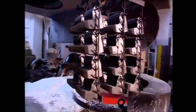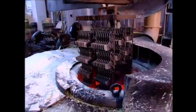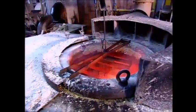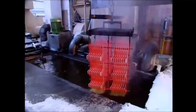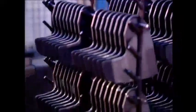The blade is nearly ready to be attached to a mower, but there's one safety measure it has to go through first. You know you're supposed to clear your lawn before you mow it, but sometimes you forget. If the blade were to hit something solid, it could shatter, so they're all sent off to be hardened. First, they are heated to over 840 degrees Celsius for almost 10 minutes. They are then removed from the heat and transferred to be rapidly cooled by almost 500 degrees. This quick cooling realigns the metal's molecules, hardening it. It's now far less fragile and more capable of hitting rocks, stones, or forgotten garden tools without shattering.